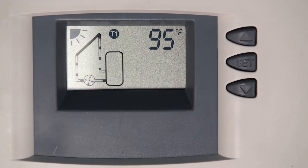The most common call we receive during the winter months is low hot water amount or low temperature — no hot water at all. This can be a result of the solar not working at all, but primarily it has to do with your auxiliary heater. If you have a single tank electric system with one tank in the garage or mechanical room, there's an electric element in that water heater that's the auxiliary heating source that's not working.